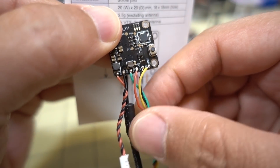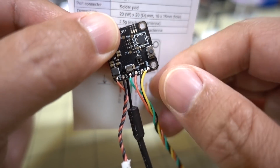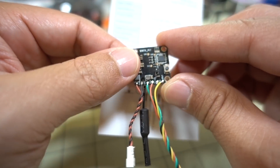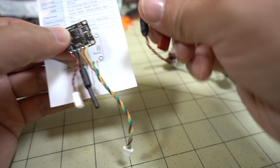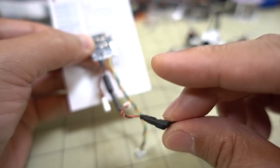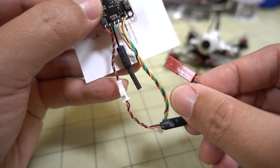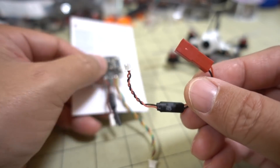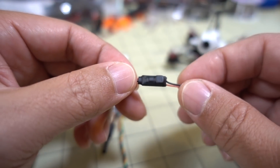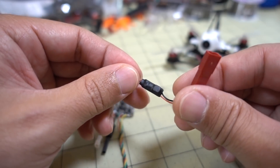These are all solder connections, so you can use these cables or nice silicon wires, or solder on the ones from your flight controller - no problem. You just have to find a UART for your smart audio. There is this little part with a voltage regulator that you can plug in here. Obviously this will only take 5 volts, but this is if you want to use something more than 5 volts to power up your video transmitter. You could use this little pigtail and plug it in. The voltage range of this voltage regulator is not documented anywhere in the instructions, so I'm thinking it's probably something like 2 to 4S.